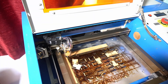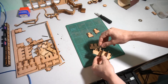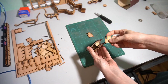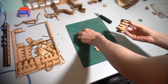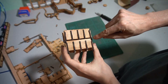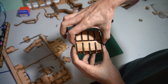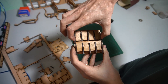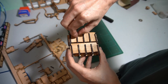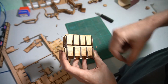This is how I assembled the first prototype. I put the three tabs in first, then the lid on, and then slid the sides on last. I then made the second one and joined them together, but it came up with a few issues — I forgot to remove material from the edge of the pin to accommodate for material thickness, which meant my edge pieces joined at a slope, and the notches were too wide so all the connecting pieces wobbled.